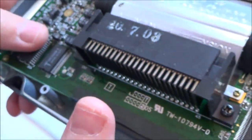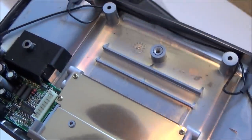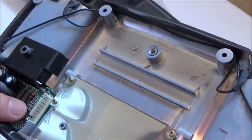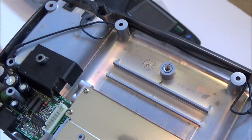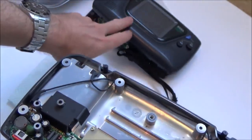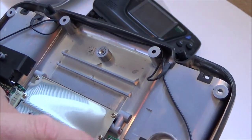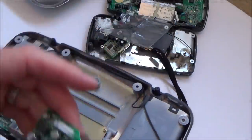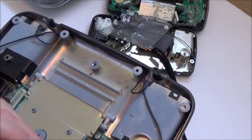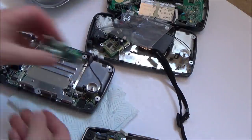Right, so what I'm going to do is... I think this is the one that's not powering up properly. So I think I'm going to put the back off. I'm going to put the power board from this one here into here just to see if it makes a difference. Everything looks slightly different. The boards between here look different. So this is the soundboard here. Yeah, some of the components are different. Hopefully the capacitors and everything is just a straight swap.